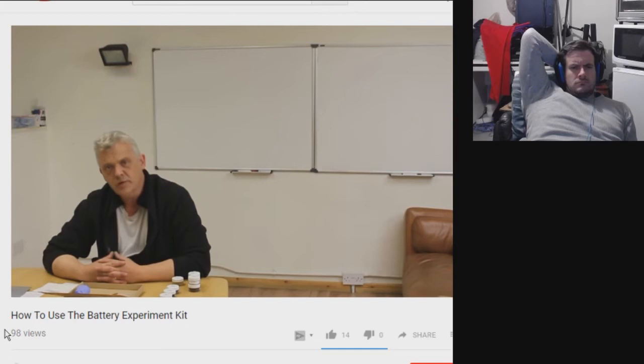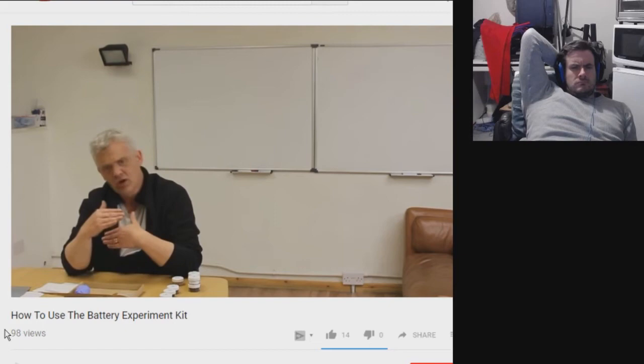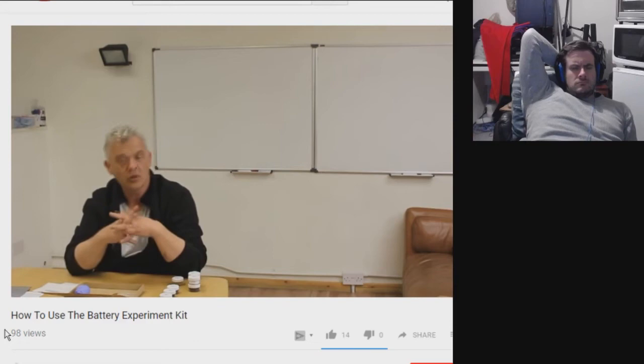Now the way that you would approach that is you begin with a symmetric supercapacitor. That is a supercapacitor made from carbon fibers. And you can increase the energy density by changing one of the electrodes into a metal oxide, which is why we give you metal oxides. Then you can change the other electrode for a metal, which is why we give you a metal to make an actual battery. So an awful lot of this can be taken stepwise in order to help you develop different kinds of supercapacitors and different kinds of batteries using the kit.